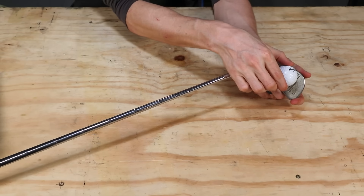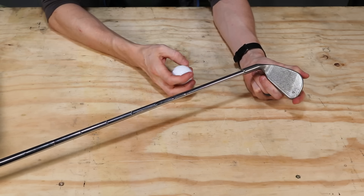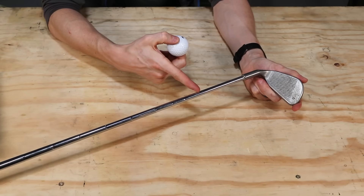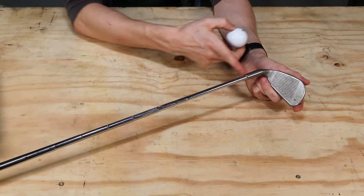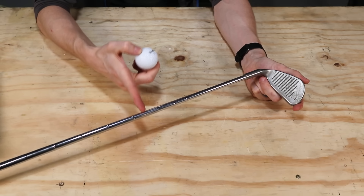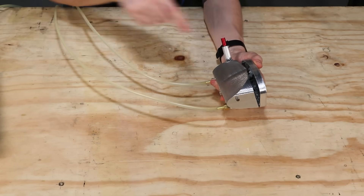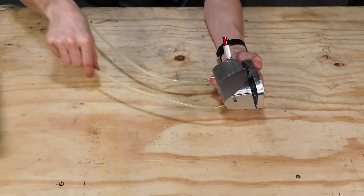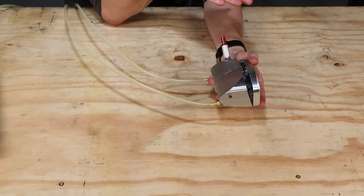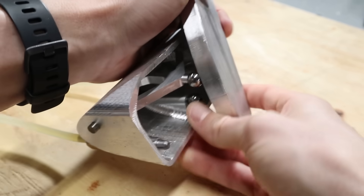When I swing the club and hit a ball, I don't feel the impact until the ball has already left the club and is flying away — and this is due to the speed of sound. When I strike a golf ball, it generates a pressure wave in the material which, as far as physics are concerned, is basically sound traveling at the speed of sound up the golf club. In 500 microseconds, the sound will go to maybe about here. I was hoping this would make my hydraulic system work even though the hoses were stretchy — the shock wave would generate pressure in the fluid going at the speed of sound, and should only travel a short distance up the hose before the ball is gone. The problem is that wave does propagate up the hoses, and the system is very springy, so all that energy goes up and then shoots right back down and launches the face of the club off.